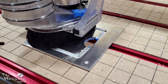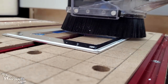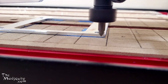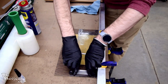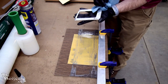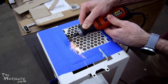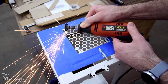Now we're making a plate to go on the outside to cover everything up. Eighth-inch end mill to bore out the pass-through holes for screws going into the GPU mount, same adaptive clear followed by contour for the inside, then a contour on the outside, and then a chamfer bit — extremely satisfying as it rounds that corner. I have a setup with a scrap of MDF, sandpaper, and WD-40 for lubrication along with a straight edge, which lets me pull the aluminum piece across the sandpaper to get a brushed aluminum look with straight lines.